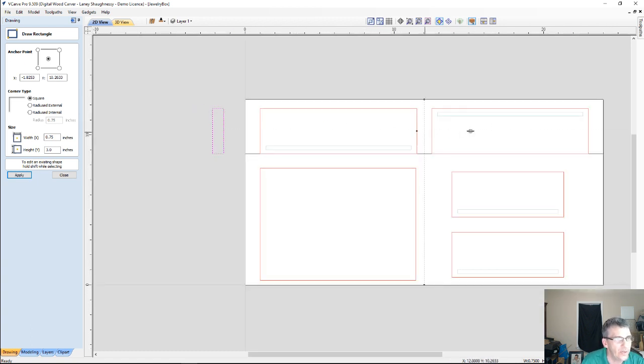But because I'm going to sweep this, the way the software looks at this profile, once I get the shape drawn that I want, I need to rotate this part 90 degrees, and it needs to be actually laying lengthwise, not vertically. You would think that we would be sweeping vertically, or be positioned vertically because we're sweeping horizontally, but it doesn't work that way. The part has to be laying actually horizontal to sweep along this vertical piece. So let's take a look at our profile.